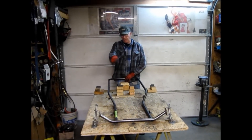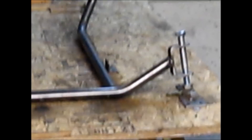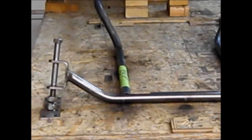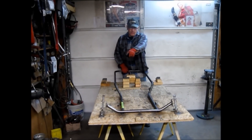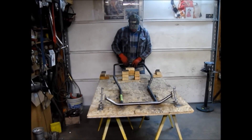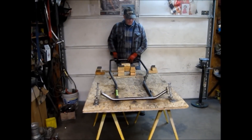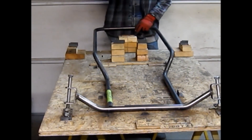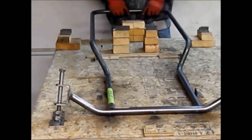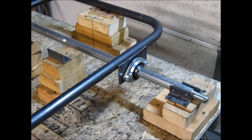I just dropped the front axle in place. That's how I hold mine once I figure out how many degrees I want everything. You already set the kingpin angle, so now this is just holding caster where you want it. Get this frame tweaked out where you want it and figure out your length. This jig is also made to do a 2-inch stretch or a standard-length chassis all on the same board. You're able to weld this all together once you get the front axle welded in. It's got a center line marked all the way down through here so everything's on center — weld it up, then you're ready to weld your axle plates on.